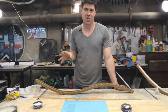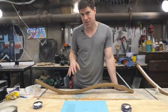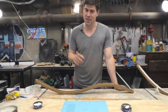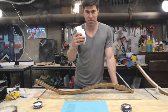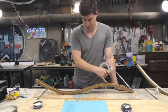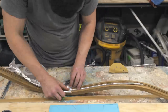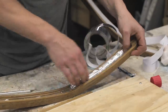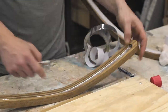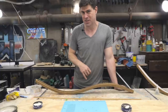I'm planning to come back later and put some one-sixteenth-inch aluminum bar underneath the LEDs to help dissipate the heat. I've got that on order but don't have it yet, so temporarily I'm going to use some aluminum foil tape in the channels. If there are any electricians out there, feel free to leave a comment on your thoughts on the best approach to dissipate heat from LED strips.